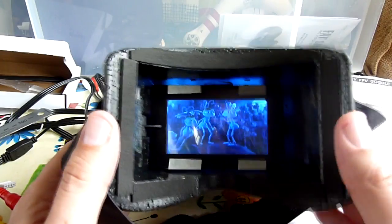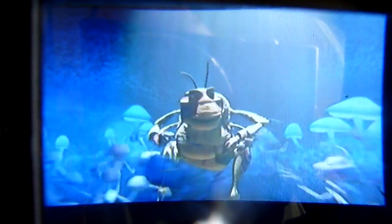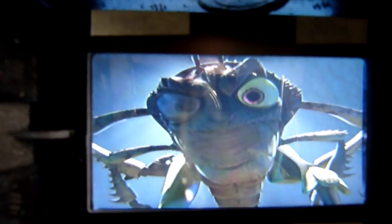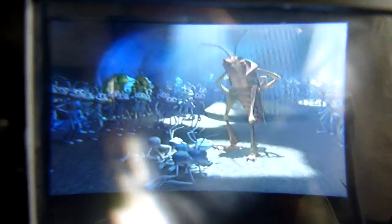I'm using the middle lens. I'm going to try and give you a view of what it looks like. The edges are quite curved, which is a bit of a funny look - I'm used to the Fat Shark goggles, so if you've never used goggles, it's fine. Moving the lens back and forward is supposedly for focus, but there's a very narrow range of actual focus. If you have it too far out, you can just see the frame in the way. If you have it too far in, the picture just distorts a bit. So you end up with it about two-thirds back.